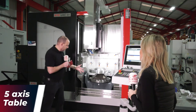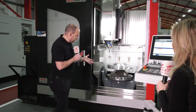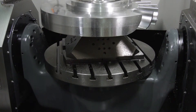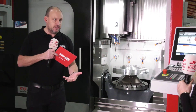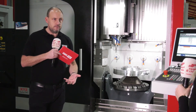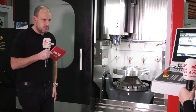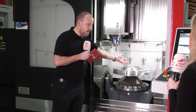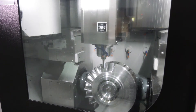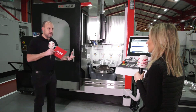Another thing that stands out is the table and how rigid it is. We're crossing boundaries between sections here, but the way this table is put together — you've got a support on the left and on the right. Some five-axis machines essentially hang and you don't have support on both ends, or there's less support on one end. Having both sides supported has to be mechanically stronger. That's one of the big things XYZ promote here, and when looking at a five-axis, I would look at how that table is supported.